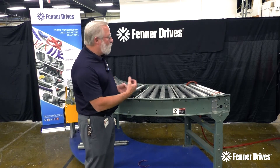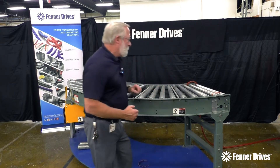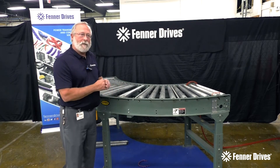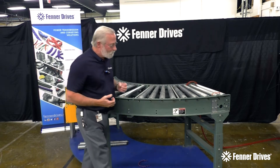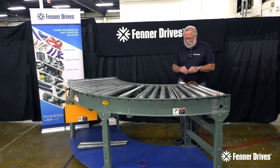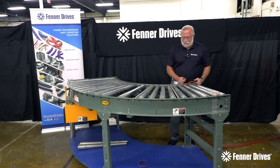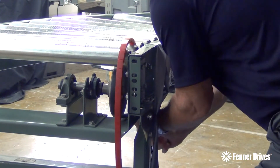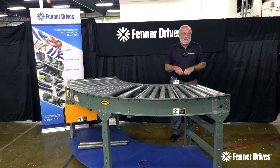Our belts do run through — the link belt runs a little bit higher in the snub pulleys than a rubber belt. We've already loosened our snubs and we'll talk about the proper tension to bring them back up. So if you're willing to cut your rubber belt — and most people are because of the time savings — I'm going to cut the rubber belt now and then duct tape our belt to the end of it. I'll reach underneath and cut the rubber belt.